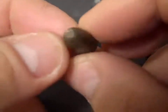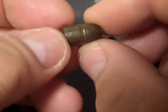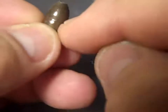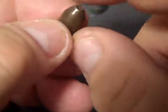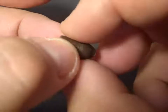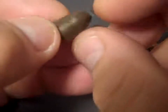Here's a normal looking one. This is what they look like when they're done. This is one coat of translucent copper powder, swaged to that diameter. Now you'll see that there's a spot on there — it's like an extended ogive. I had to make that because the ogive was starting right at that line, and I made up some dummies to see how they would cycle. They were getting stuck because the ogive wasn't thin enough or long enough at a thinner diameter. So I extended the start of the ogive back a little bit.